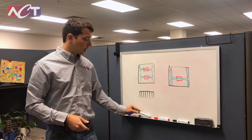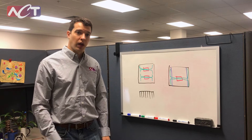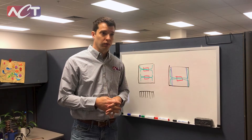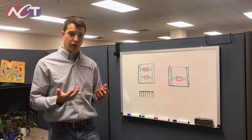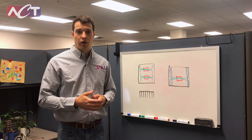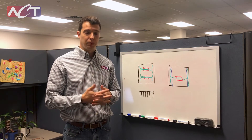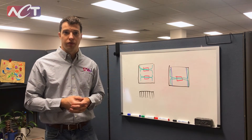Those are the basics of a high K plate and how you can embed heat pipes into a plate. Here at ACT, we typically use either a thermally conductive epoxy or a solder to embed them, and can get pretty close to the original geometry of your card.